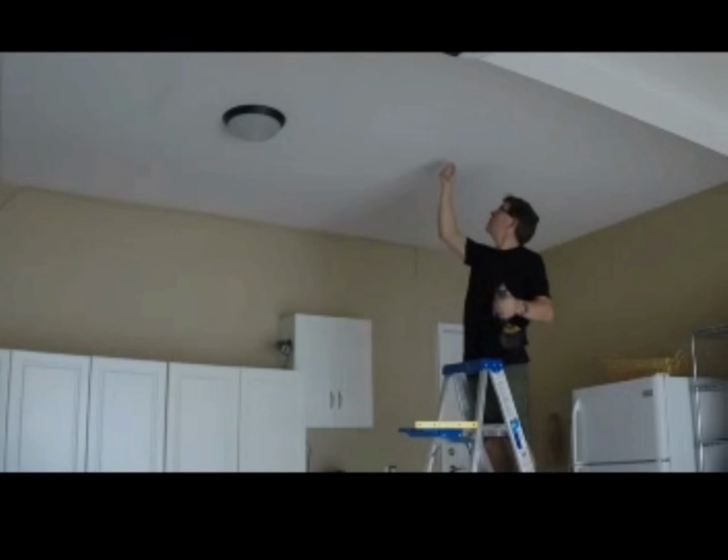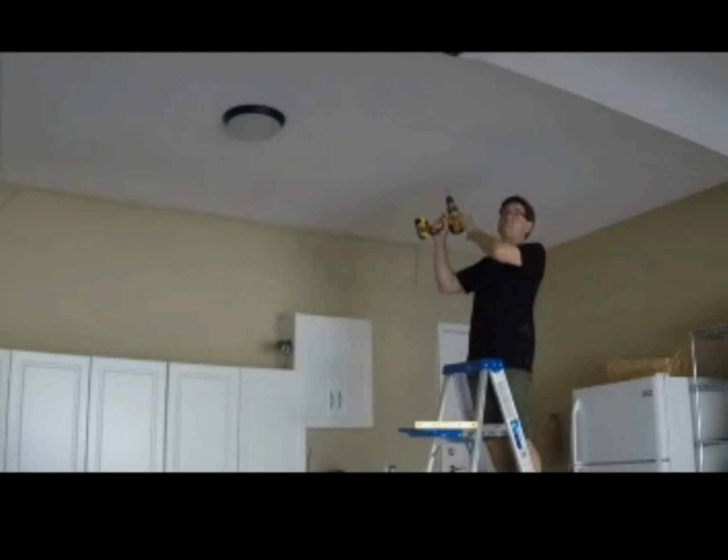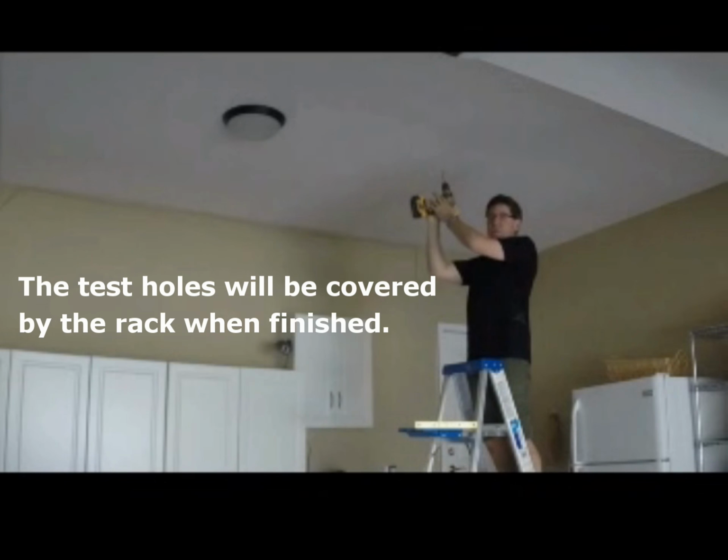So I know that I can't totally trust my stud finder. It gets me close, but I have now determined where I want my initial hole. So now that I've offset my hole by 3/8 of an inch towards the wood side from my original hole location, I'm going to drill my 1/4 inch hole to put my lag bolt into.